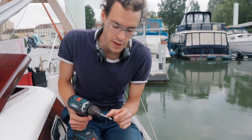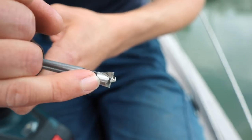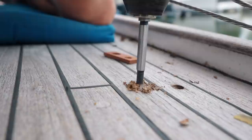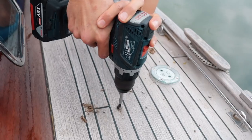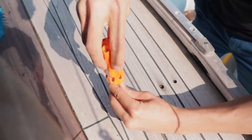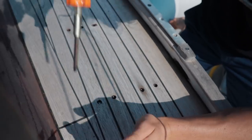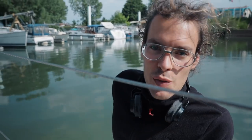There are also devices that prevent you from drilling too deep — you can set the depth. I do it by eye. Don't drill too deep, because otherwise the screw is not going to hold the plank down anymore. The screws can go in right after drilling the holes deeper again, and then I'll proceed tomorrow with the bungs because it's getting late and a little squally — you don't want to do epoxy work when it might rain.